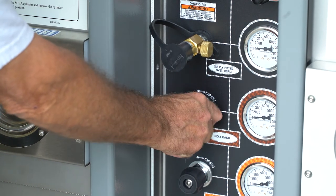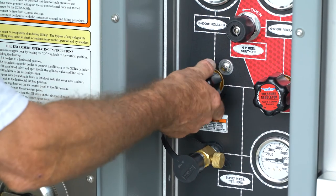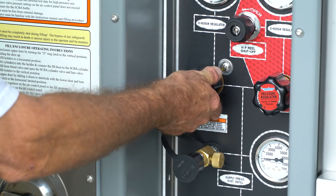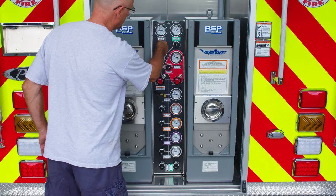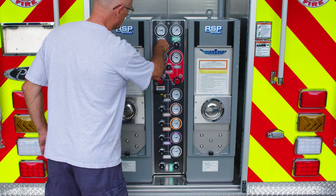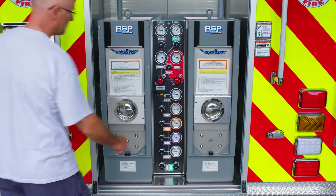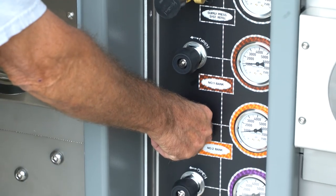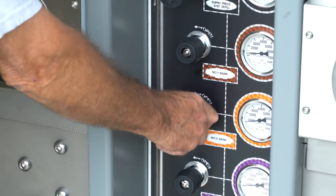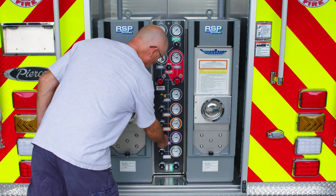The supplied pressure gauge must show more pressure than what is needed at the regulator. To adjust the air pressure, fully push in the regulator knob and then turn the regulator clockwise to increase the pressure to the desired amount for the SCBA cylinders loaded in the Space Saver filling station. Now open the fill valve slowly and allow enough time to prevent hot fills — some only need a very small turn. When you hear the air slowing down or your SCBA gauge shows significant air transfer, close bank 1 and open bank 2. Repeat this process as needed for bank 3 and if necessary bank 4. If the SCBA is not full with bank 4 open, open the booster pump valve to top off the SCBA.